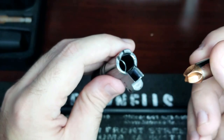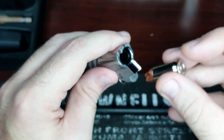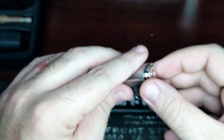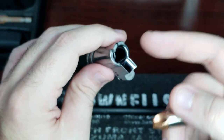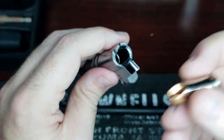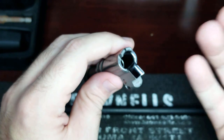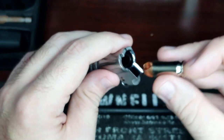This in combination with fixing the magazine lip angles, so we have a different angle of feeding into the chamber, will help correct the problem. Now, this is the first step. We're fixing or addressing the issue of the barrel. We try it out, see if it works. If it keeps on giving issues, then we move on to the magazine and adjust the magazines for the feed angle.